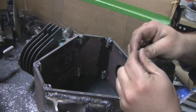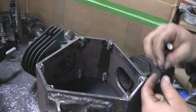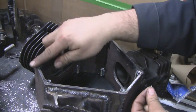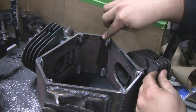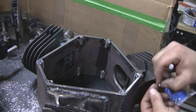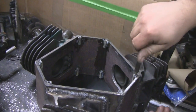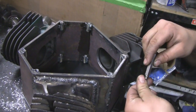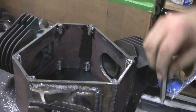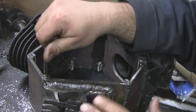In this case we've got six of them. Once these are all put in and set to the same height, the little tip sticks up slightly above the surface. Then you set the cover on, position it where you want it, take a hammer, and hammer on the cover right above each of these little punches. It transfers a center punch mark — puts a punch mark right there — and you know they're exactly aligned with the center of each hole, so when you drill them they all line up.